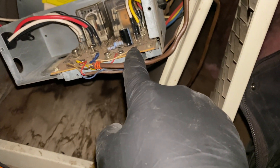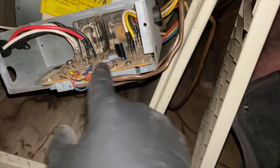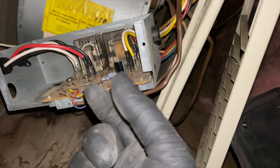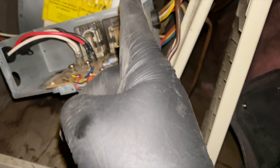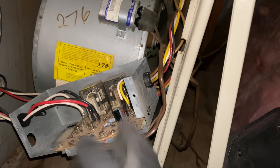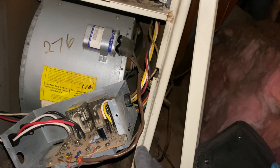When you go to W you're going to get a tone — that's because it's connected to C, and C is connected to ground. The only real way to check is to take all the wires off. I inspected everything and can't find a short. So what I'm going to do is put a new transformer on and put a fuse on it — I have a popper, which is like a little breaker, so if there's a short we'll find it that way. I checked the capacitor — it's out of spec. The blower motor ran in full speed, only pulling three amps, so I think the motor is okay. I'm not sure if the ignition module is still good, but we're going to start with the transformer and go from there.